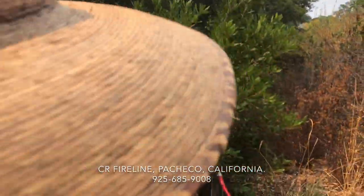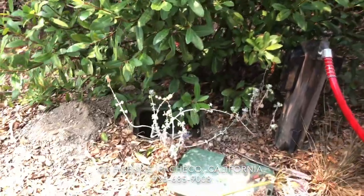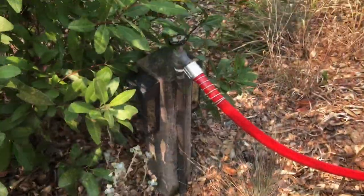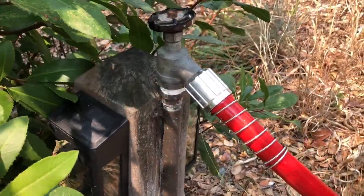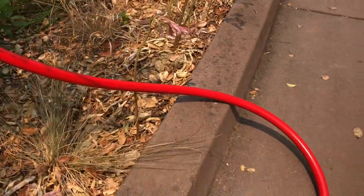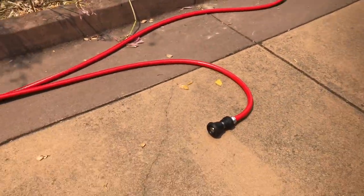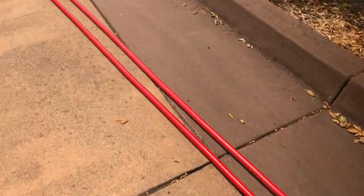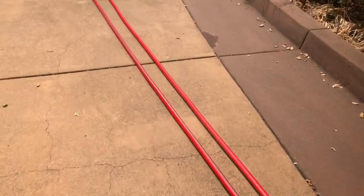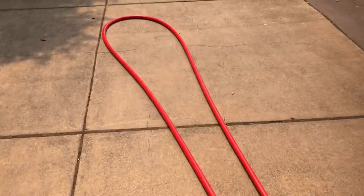We'll go down and take a look at the fire hose in a moment. If all you have is a five-eighths inch line, some water is better than none. I'm actually setting up multiple hoses all over. We could probably run one inch-and-a-half line on this property and put out a ton of water, or we could run three or four smaller lines. I'm going to put the smaller lines out at multiple locations.